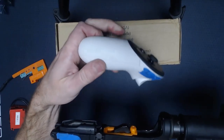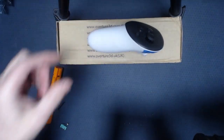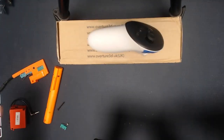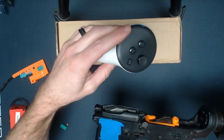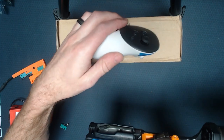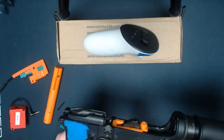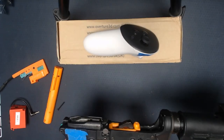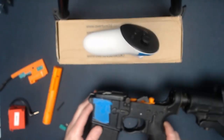I'd want to stick with the same control scheme. The grip button would need a Bowden tube-based rod to a weapon light that can mount up on the front rail section. There'd also need to be rod linkage from the magazine to track state on the A button, and the charging handle and bolt release would both map over onto the B button. Since the pistol is right-handed based, this will need to be left-handed based so we can have both weapons at the same time.